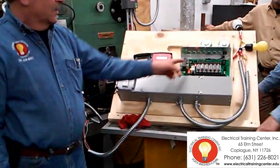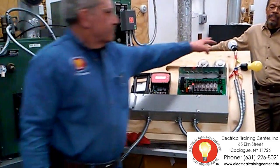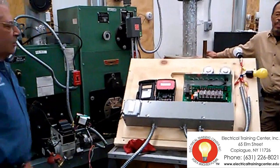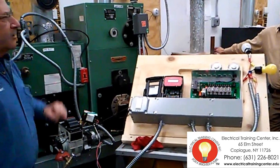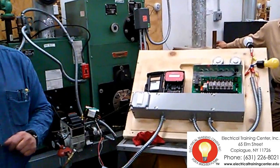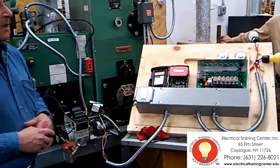As you can see, we're energizing the zone. On the Argo panel, it's telling us that a thermostat — zone number one — is calling for heat. But we're not going to have any circulator operation just yet, because the Aquastat will also monitor and control when the circulator is allowed to come on. We certainly don't want the circulator coming on and circulating cold water.